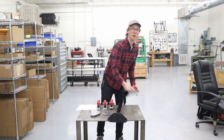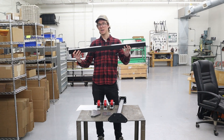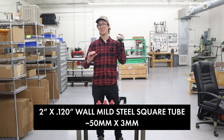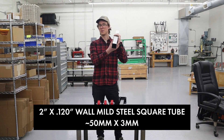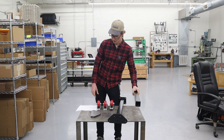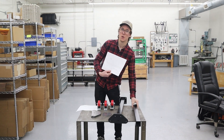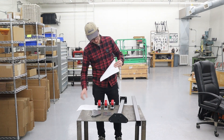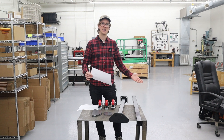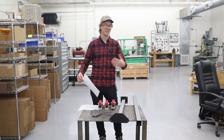The parts are two of this lower leg — it's two-inch mild steel square tube, 120 thousandths of an inch wall thickness, which is about a 50 millimeter square tube by a 3 millimeter wall. According to the part print, it'll tell you where to place the five holes and their diameters. It has square cuts on the ends — you don't even need to weld anything. It's really simple.